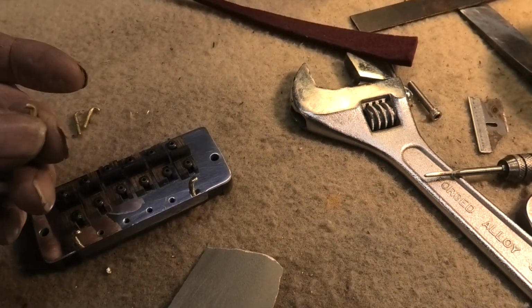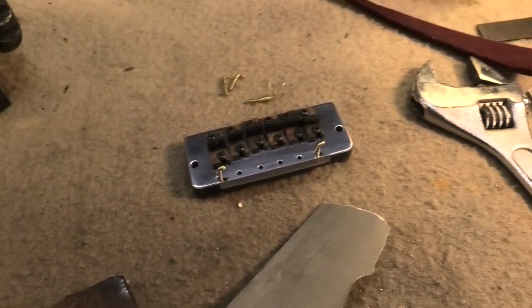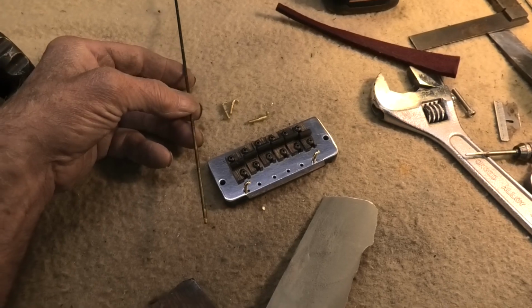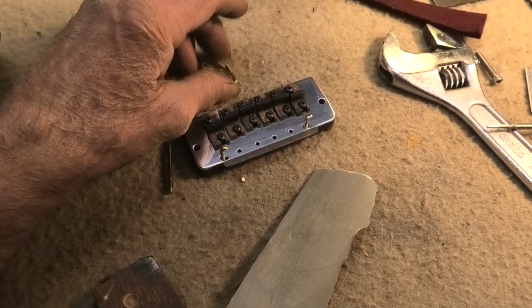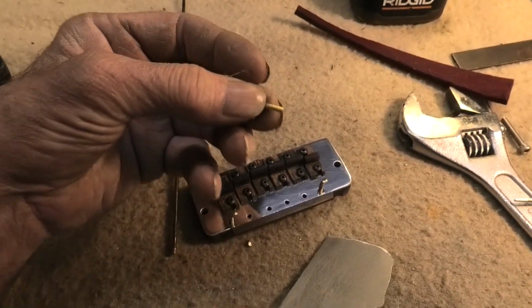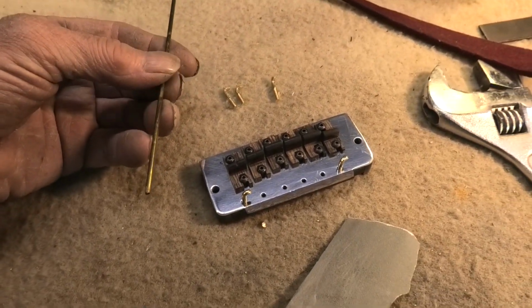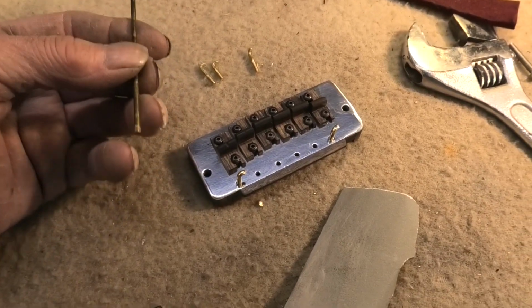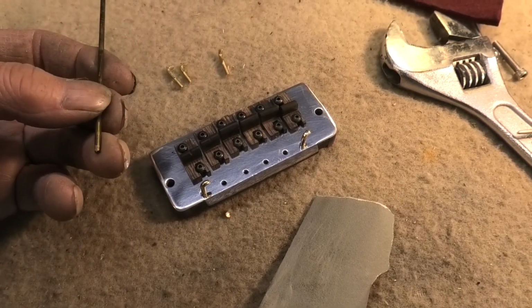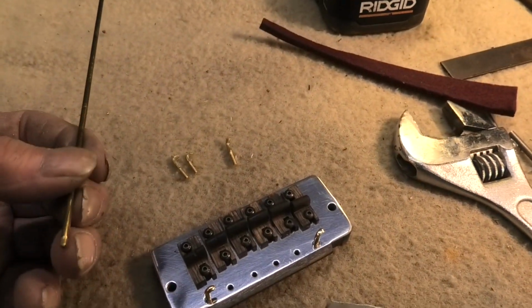It's just a brass rod that I had to get from a piano, because I bought some brass rod that I thought would be correct at the local True Value Hardware store. And I had trouble threading them. They were coming out all wicky-wacky, all offset from the center. I didn't know why. So I took the micrometer and I suspected the roundness of the rod was off. And it certainly was. It was just oval. Very bad. This one is almost perfectly round.